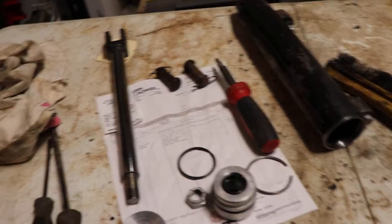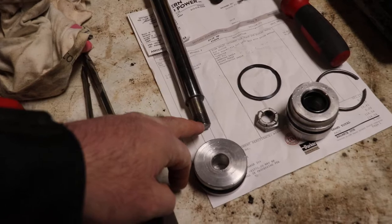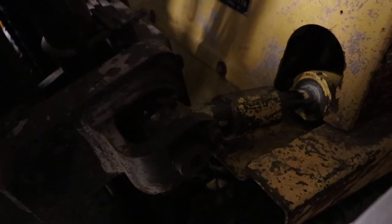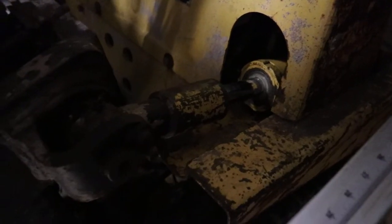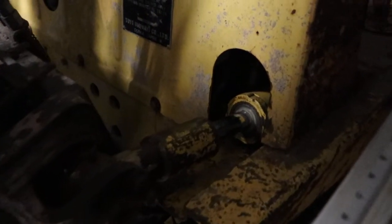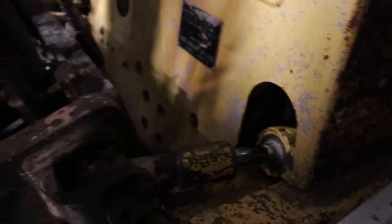When you're looking at a cylinder with an attachment on the end of the rod, you can anticipate there's going to be a nut on the other end. Whereas with tilt cylinders you can just take that part off and slide everything out - that gives you an idea whether you're going to have a fight with a big fastener on the inside. With the tilt cylinders, I should have brought both caps in and had them machined to make it easier to put the seals in, because every time you pull the mast back it smashes these parts into the glands and damages the space.